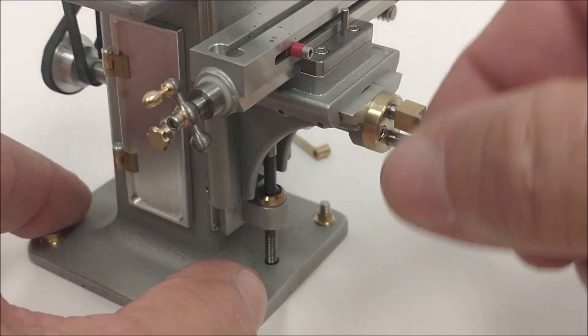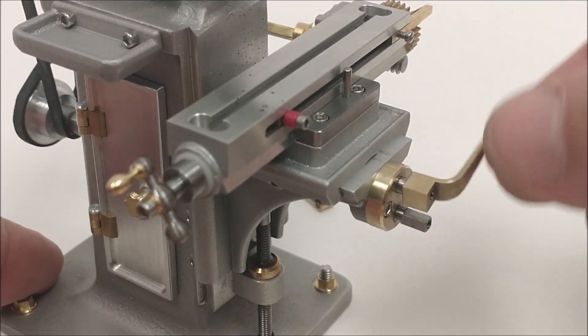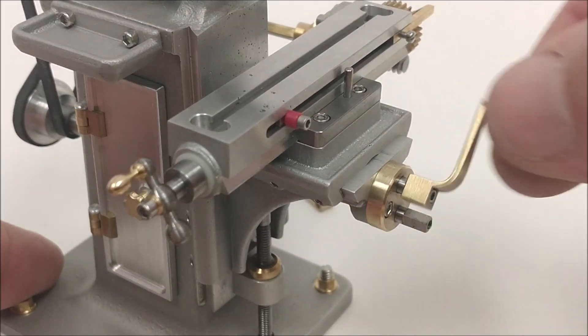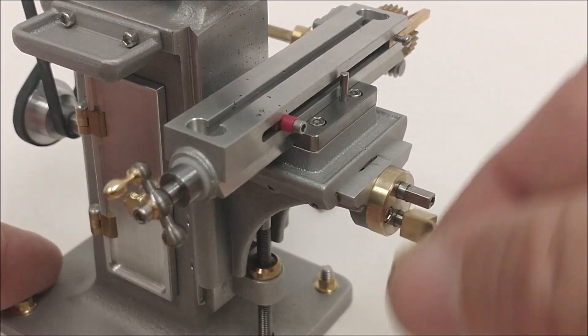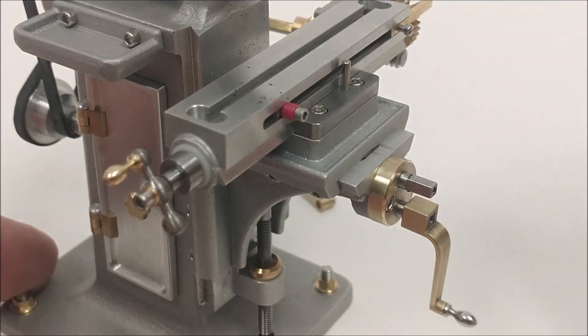The dual drive mechanism located directly in front of the machine is an interesting setup that I had never seen before. The top drive shaft moves the table in and out on the Y-axis — ever so smooth with those gibs in there, just like butter. The bottom one raises and lowers the table. You can also see some gib screws on the left-hand side just below the crank.